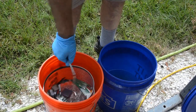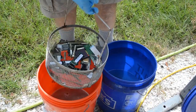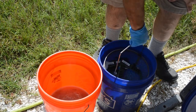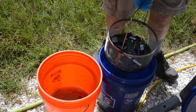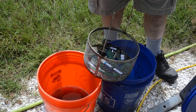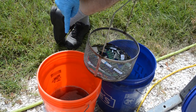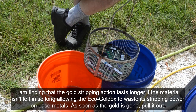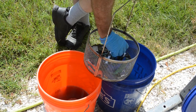If you do this in a tall bucket and do this really fast, you're going to fling all of the remaining liquid off of them, so you get less carryover into the rinse water — and that's a beautiful thing. You don't want so much carryover into the rinse water. Sort of ring them dry like that, then dump them out on the bench and sort through them. Anything that still has some gold on it will go into the next batch. Less time in the stripper means the stripper has less chance to take out base metals like copper and tin. As soon as the gold is gone, you pull it right out and put it in the rinse water and stop the process. Don't let it sit in there and keep stripping off base metals — you don't want that.